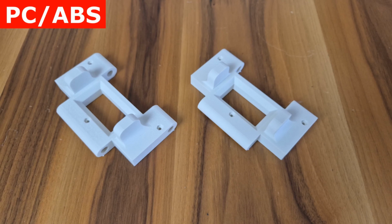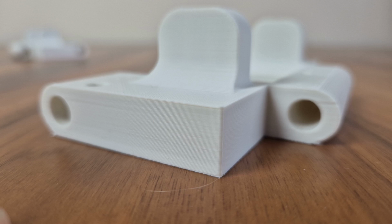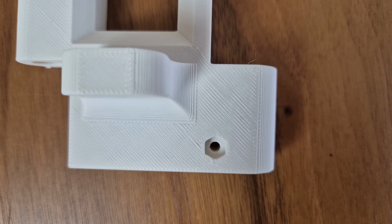I made the necessary adjustments and even sprayed a bit of hairspray on the print bed to achieve this printing, you see. The reason I used hairspray was to make adhesion easier. I didn't encounter the slightest problem. I achieved a very successful result with minimal sagging at sharp angles without experiencing any adhesion issues on the print bed. If I had to mention a minor issue, I would say that nozzle marks appeared on the top layers.